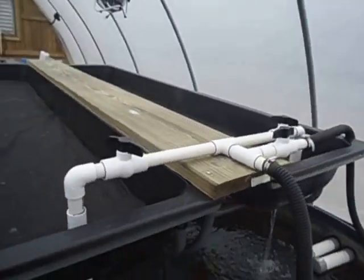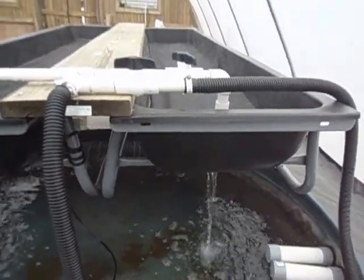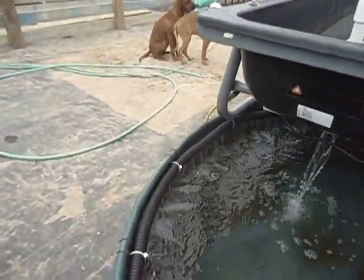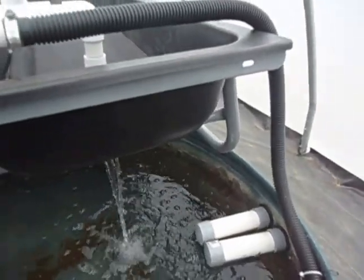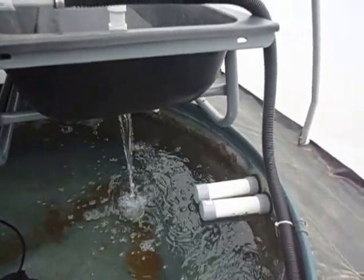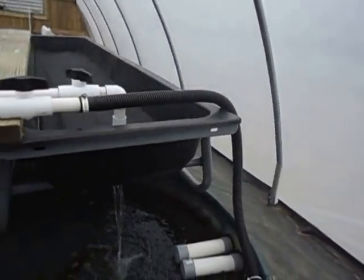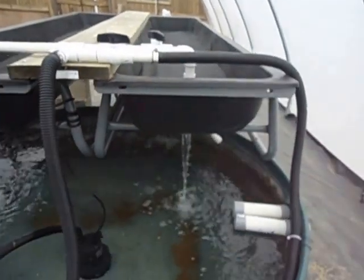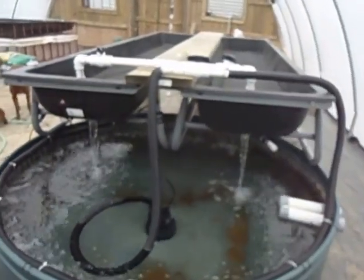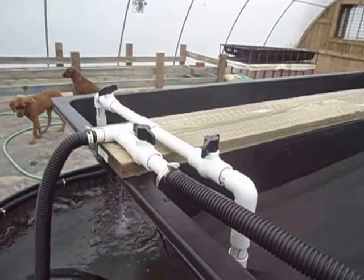As you can hear on this one, it is running. You can see how the water comes out of the tank and how the main tank has aeration all the way around. These two-inch pipes will eventually go outside to our main tank, which is over 40,000 gallons. We will put plants in this system this week, and the soil. And in about five weeks, you're going to see this system with the plants still in it and how it operates.